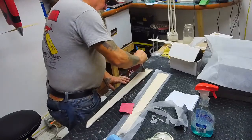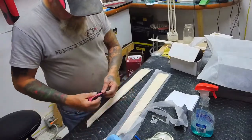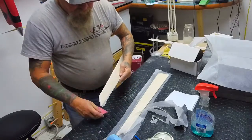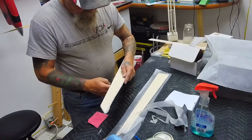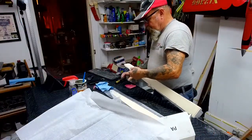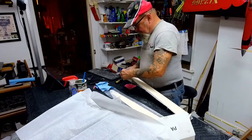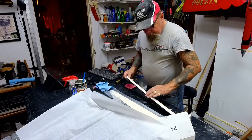That's two coats. You got to keep track of the coats too, because if you put odd amount of coats on things in the sun, they'll warp. But they will be laser straight when I'm done. There's not a big rush in this, but you need to get the hump on. Can't dilly-dally. You don't want the wood to take a set.